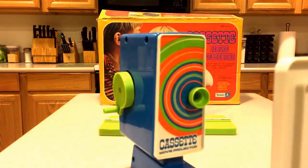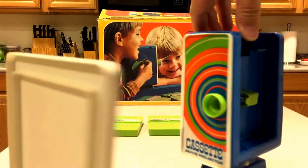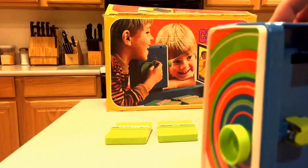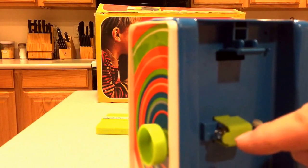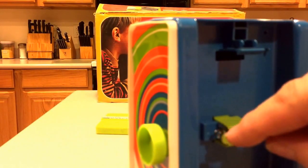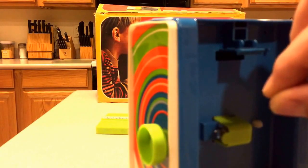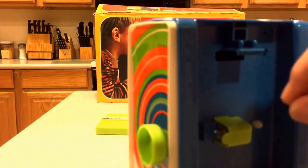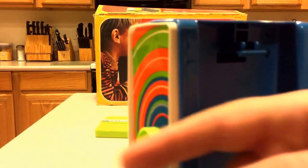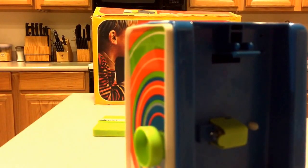Here's a view of the front. This is the focus, which doesn't really need too much. The tricky part is it takes a special bulb — it's like a penlight bulb and it has a small glass bead in the end, which acts as the focusing element. It directs the light from the bulb directly through, and that is a critical part. If you do not have the correct bulb, it will not work.